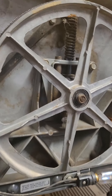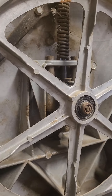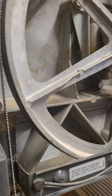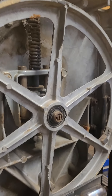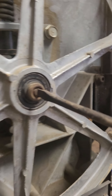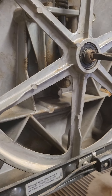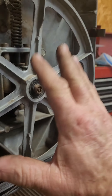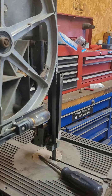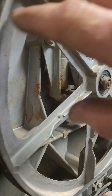It's actually not very hard at all, just requires a flathead screwdriver. Stay clear of the blade — don't get hurt, don't cut yourself. This top wheel is a driven wheel; the bottom wheel is the drive wheel. You'll take your flathead screwdriver on this little piece right here and go left and right, which tilts the wheel fore and aft, and that aligns the blade to the center of the driven wheel.